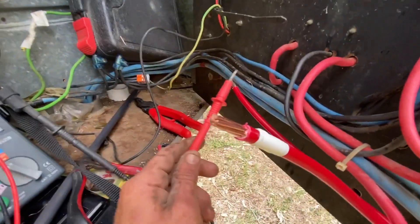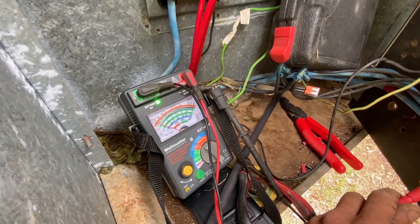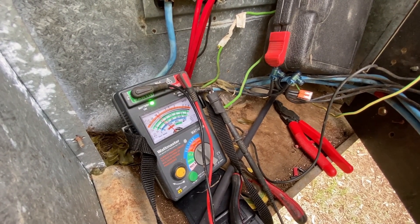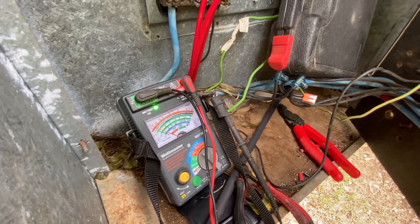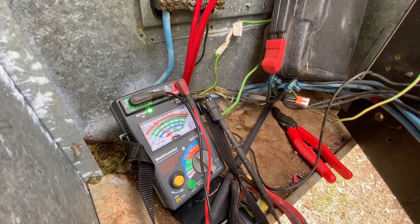She's full and now it's just starting to set - you can see it's slightly starting to change. I've topped it up so many times, I'm just going to sit back and let it set, then we can fill the trench in. Okay, testing now - it's hooked up to earth. Let's check one phase - that's clean. 500 volt test, that's 10 meg - definitely a pass. The other phase is going way down - there might be a neutral issue. I'm going to go join neutral to earth in the board because one of these is a black cable and I need to put some heat shrink on it.